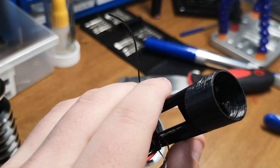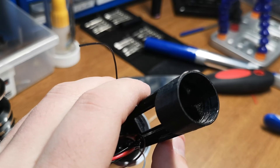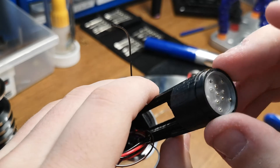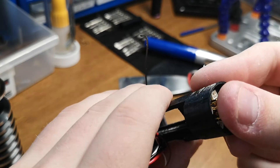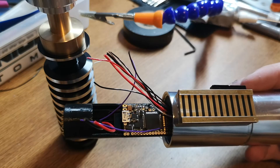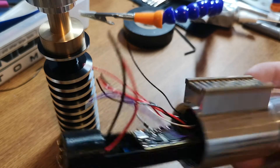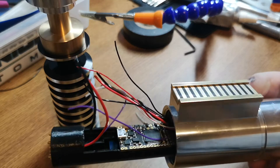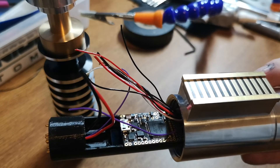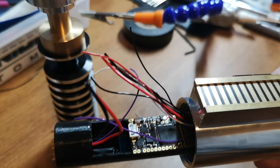Next, we're going to wire up the top section. If you're doing NeoPixel, your connector's going to be a little bit loose as this is designed mainly for compatibility. I designed and 3D printed a little adapter piece for a more snug fit on the entire assembly — it's easy enough to design and print if you have a printer, otherwise glue will suffice. We're using the long pin connector as this is a fairly deep socket part. Once we've got everything prepped and routed, test all your leads with a multimeter and benchtop power supply. We've got our OLED on the bottom and our crystal focus on top — you can decide how you want to route the wires, either along the top, the bottom, or a combination of both for the cleanest routing. I want easy access to the USB and SD card while keeping everything clean and functional.